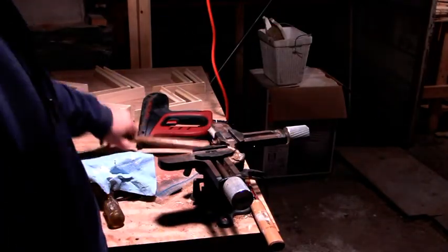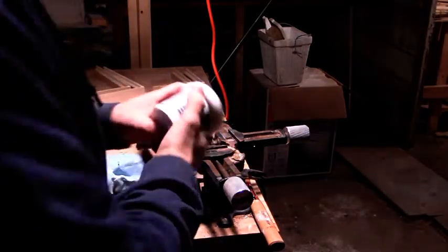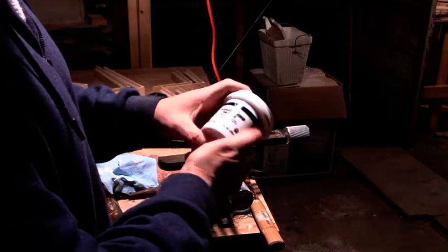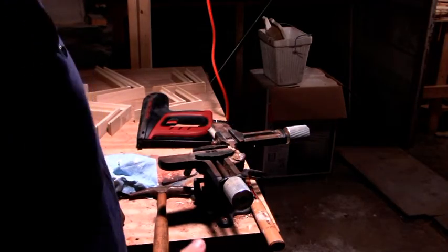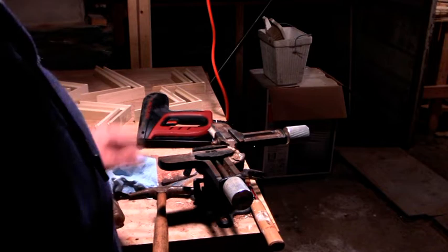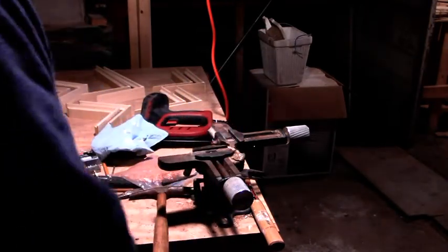You'll also need a small hammer and a nail punch. And the key — the beauty of this — is a little jar of paintable spackle. I don't use wood filler; I found it too oily and it dried up on me. With paintable spackle I can fill the nail holes right away during assembly rather than having to fill them later after the finishing process upstairs. It just saves a step. You'll also need some wood glue.